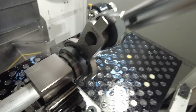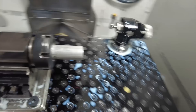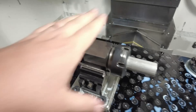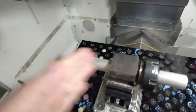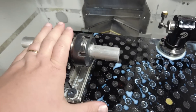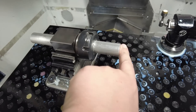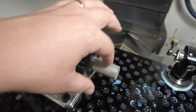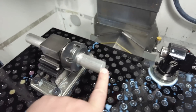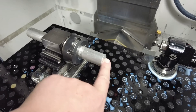With one click on the torque wrench, our setup is complete. This is our pseudo fourth axis — we have the collet block and a vise. There's plenty of room to stick material out the end, so this should be fairly material efficient. And now we just need to set our work coordinate system. The program has a probing routine that will dial it in all the way; right now we just need to get close. And I think I'm just going to eyeball it. Does that look centered to you? I think it looks centered to me.